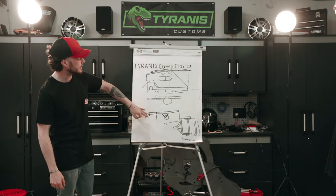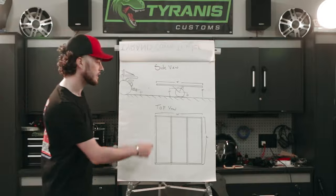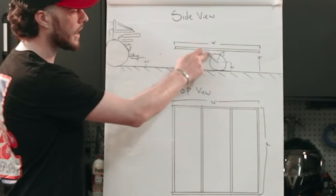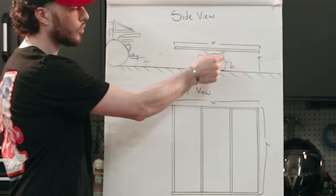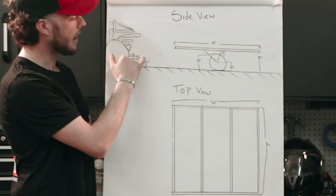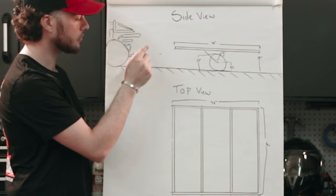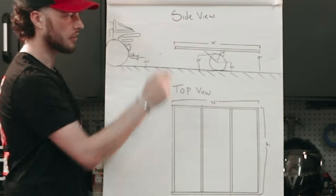Today we're going to be focusing on actually building the trailer section. It's going to be pretty simple — a three foot by three foot steel square tube platform, and then from the bottom of that I'm going to make a sort of modified swing arm that will hold our axle in place. Our trailer hitch is going to be about 12 and a half inches off the ground coming off the back of the red cart, so we just have to figure out how to make a tongue that goes from there and attaches to under here, which is about 19 inches off the ground.